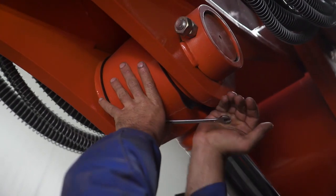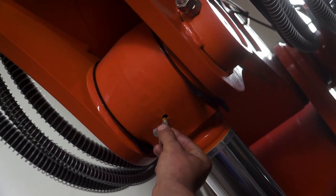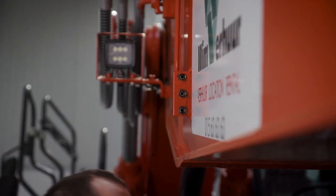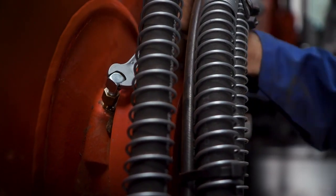The individual identifies all lubrication points by walking around the equipment. He then removes all grease zerks that are installed on the factory equipment and replaces them with the proper lubrication point fittings. These fittings could be elbows, straight fittings, 45-degree fittings, or even reducing fittings.